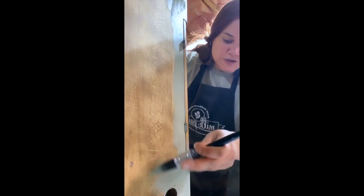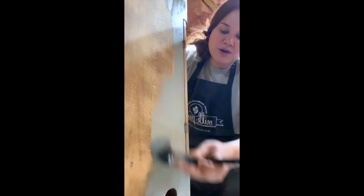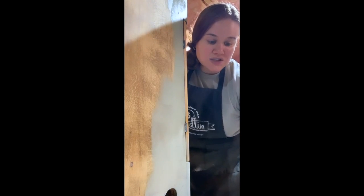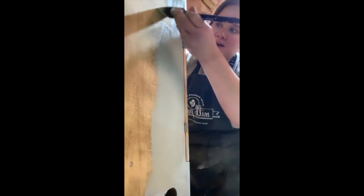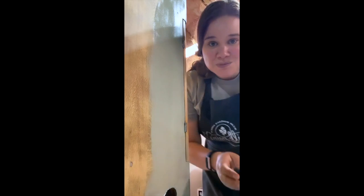In case you're wondering why you'd go to all the work of making Miss Mustard Seed's Milk Paint do the non-chippy look — why not just use a more modern paint? It does take more work to get full coverage and avoid chipping unless you're on raw wood. But here's the thing: when this paint dries, it gives you a very flat, non-shiny finish. It soaks into the surface and becomes one with it — it actually becomes part of the piece. It gives you an authentically aged finish that makes it look like it was always this color. Plus, Miss Mustard Seed's color palette is unbeatable — you can't find those colors anywhere else.